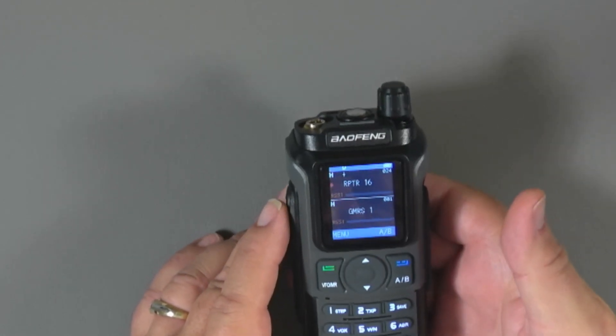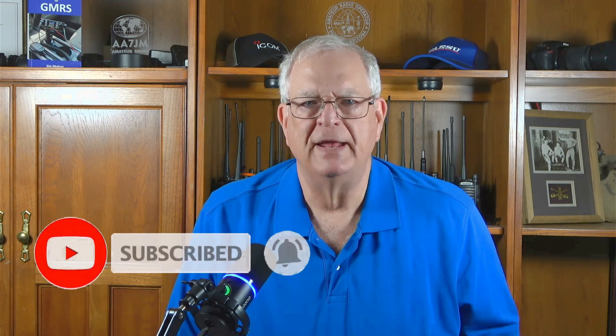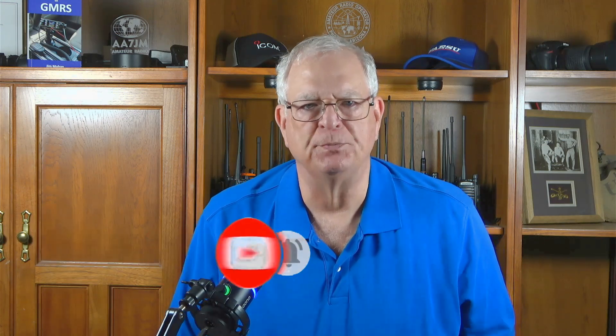That's a quick power-on tour of the GM21. A very natural question at this point is what's the radio's range? It's pretty much the same as other radios in this category. From my back patio, I can hit the repeaters I normally hit with other small GMRS HTs. Geography plays such an important role that range figures can vary significantly from user to user. What is worth looking at is output power — let's put the GM21 on a power meter.